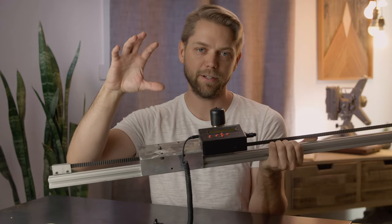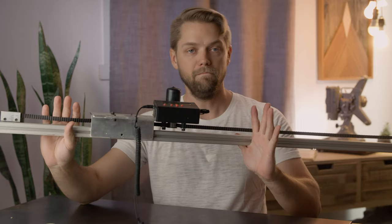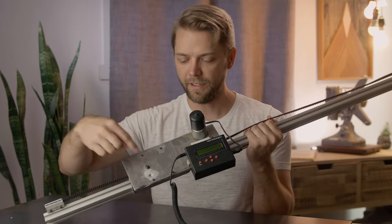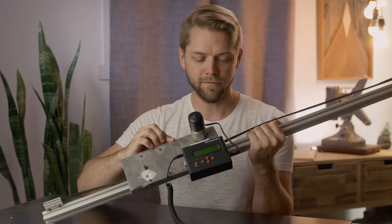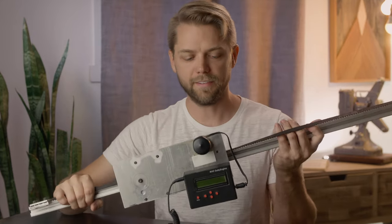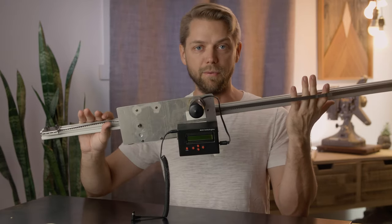Battery here, tripod head, camera here — I'm good to go. Pretty light, strapped to the back of my backpack. I made all this myself — drilled the holes, tapped them out, got everything with quarter 20s, 3/8-16 for the tripod head, got the motor bolted right to this plate, Velcro for the battery. This slider was made with basically three tools: a drill, a tap, and a grinder to cut the metal. Pretty easy — I'm happy with it, works great.